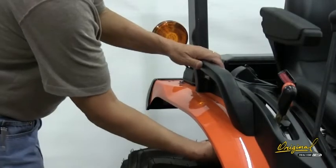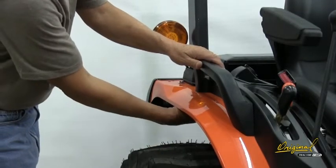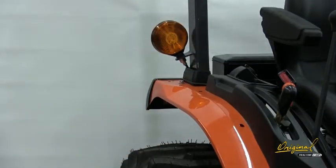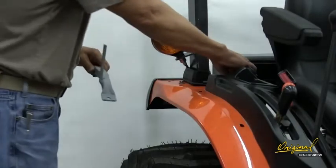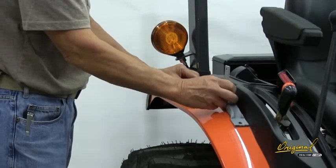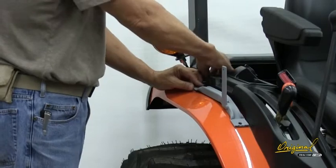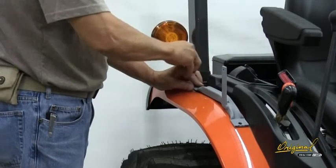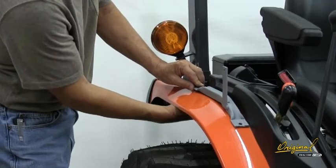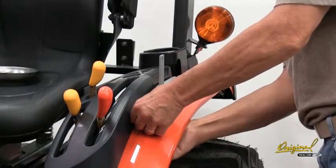Step 6. See Figure 6. Install right and left rear brackets 9 and 10. Remove the nuts and washers from the handles at reference B and remove the handles. Place a 5/16 by 1-1/4 inch thick fender washer over the holes. Place the right rear bracket over the fender washers as shown. Insert two 5/16 by 1-inch bolts down through the holes. Add the two removed washers and add 5/16 lock nuts. Do not tighten at this time. Repeat on the left side with the left rear bracket.